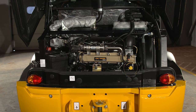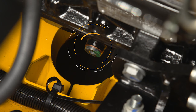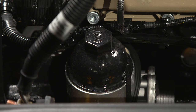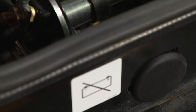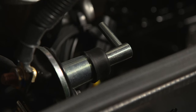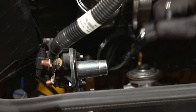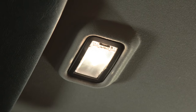There is a remote engine oil fill point for ease of access. The engine requires between 11 and 12 litres of oil. To drain the oil, undo the plug and drain into a suitable pan. The engine oil filter is located here and is changed every 500 hours, in line with the engine oil service intervals. The machine battery isolator key is located at the rear end of the machine. Depending on the specification or local legislation, the key may be inside or outside the engine bay. Remove the isolator key to secure the machine when not in use and when carrying out any maintenance — removing the key also prevents the battery from draining if a light is left on, for example.